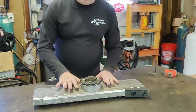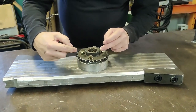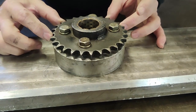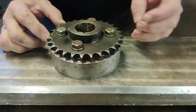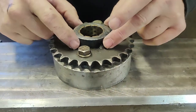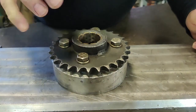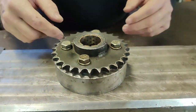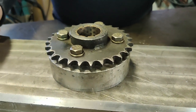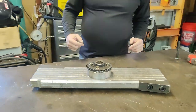There's one more thing to do. To keep the whole weapon assembly from sliding up and down on the shaft, I usually tack weld the sprocket to the shaft. You can actually see one of those tack welds cracked, so I'm going to reflow those. It's kind of a cheap way of doing engineering, but it keeps everything from moving, and if I ever need to take it off it's really easy to just spin it in a lathe, cut the welds, and take it back apart. Then that weapon bar should be done.